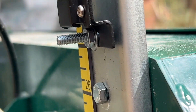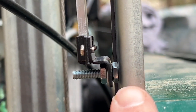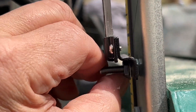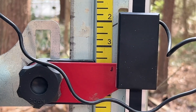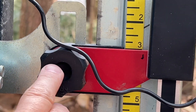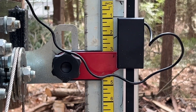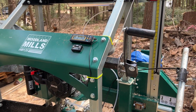At the bottom I used a 10-32 screw with a nut on the inside so the stud stays in place. If I want to take the readout off I can just loosen that screw and pull it off. It's still a little bit loose but I'll tighten it up. What's cool is I can still use the gauge as-is — if I wanted to put a kerf gauge in there I could, and the adjustment knob still technically works too. Anyway, that is the iGaging digital readout — it was $50 on Amazon.